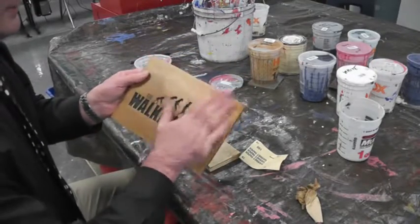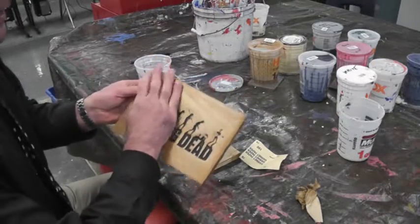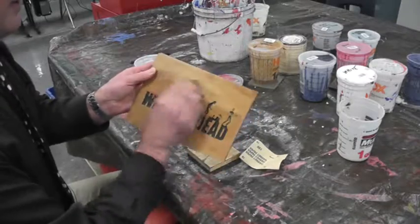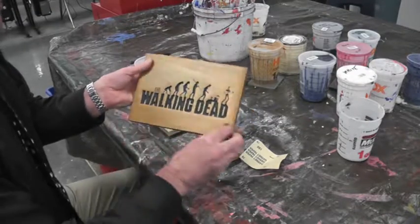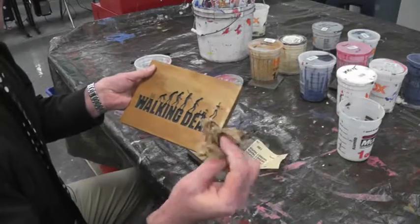Very light, very quick — I feel it now and it feels nice and smooth. That's all it took, just a couple of seconds, really light. I'm going to wipe it with a damp paper cloth. This isn't soaking wet — I'm not getting my project wet because I'm about to put a second coat on and I don't want water on it, so it was just barely damp.